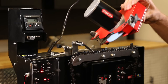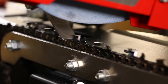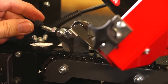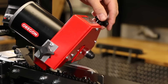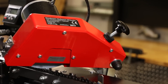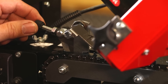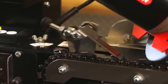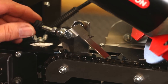Pivot the motor head down, close to the cutter — note the grinding wheel is still off. Position the cutter under the wheel and turn the chain pusher adjustment knob to allow the grind wheel access into the cutter gullet. Next, adjust the grind depth setting by turning the knob located behind the motor head. The wheel should not be set lower than the original cutter gullet. With the depth set, adjust the chain pusher forward to establish contact with the cutter and assess the amount of material to be removed. For setup chains, this should be minimal.